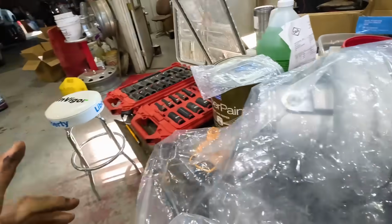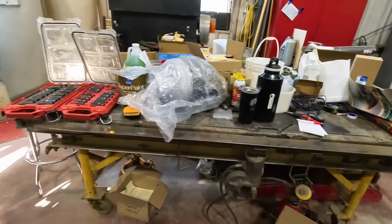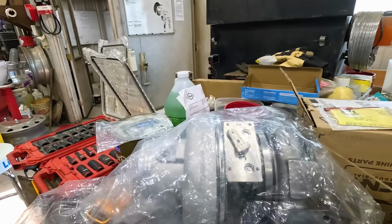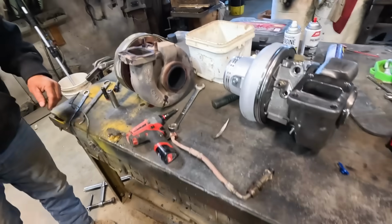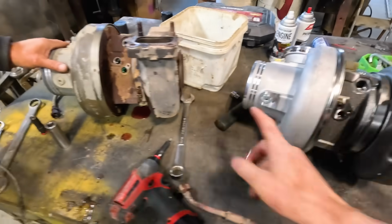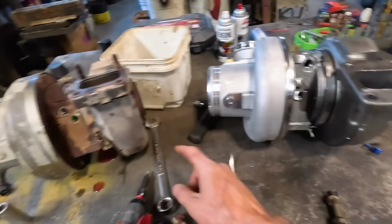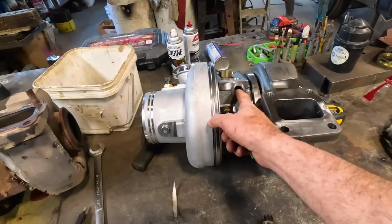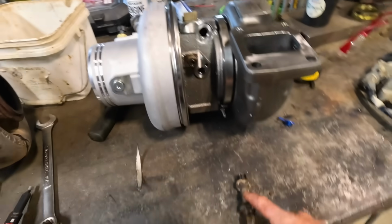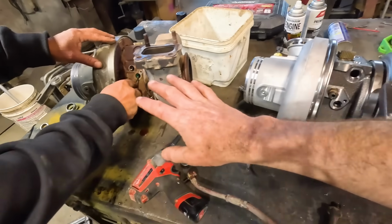Here's our new one. We have some lines. Warren took it over to the welding bench because there's clearly more room over there. Some oil lines, coolant lines, and the actuator. We've got to take off of that one, put on this one. Okay, so we're getting all of our stuff switched over. We've got the oil line off. So oil line here, sensor here, coolant line, this guy here, but he has to go on last because he tied it. The actuator can go on after we get all of that stuff on.